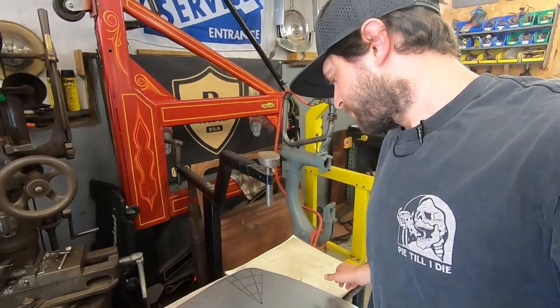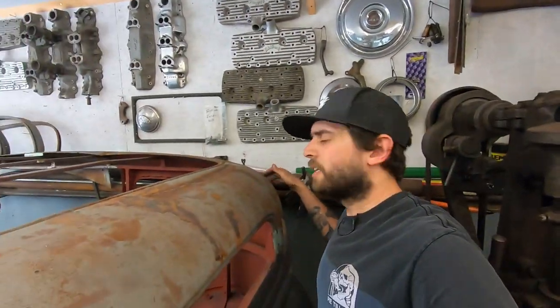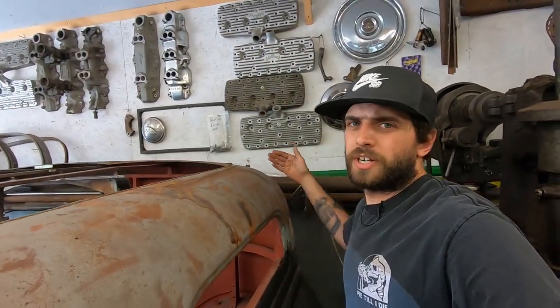on the Vicky. So I'm gonna do a little bit of this roof patch here, try and shape this patch, get it fitting the way I think it should. I'll make some radius gauges from a flat piece of stock on the other side of the roof here, just to make sure I got the right contours. And we'll start cooking. Hopefully we can make this in by the end of this video. That'd be cool. Get rid of that Frankenstein, man. I can't get over that.